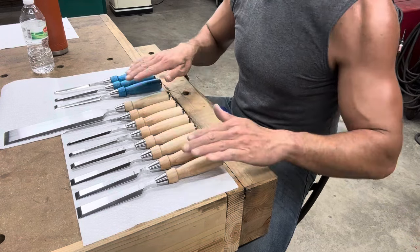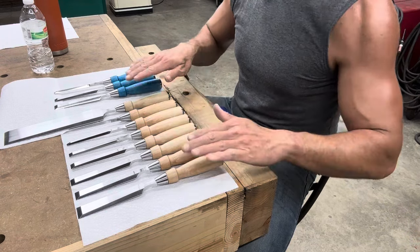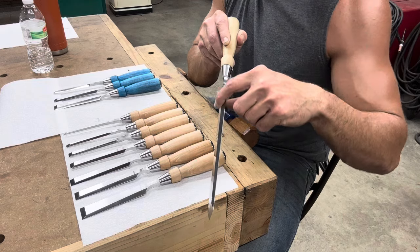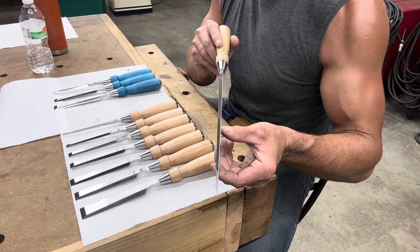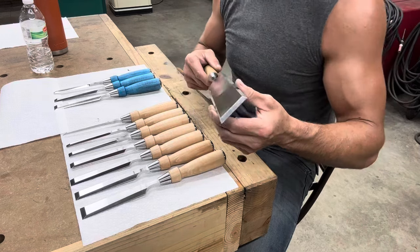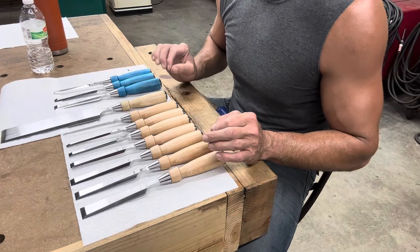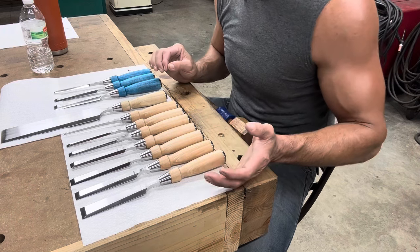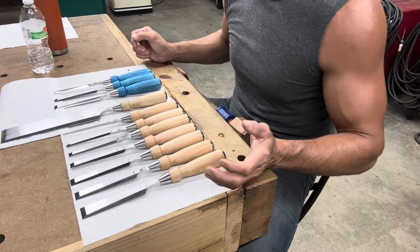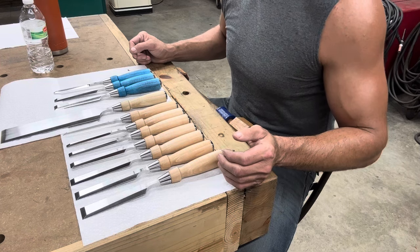It's always a challenge no matter what tool you're making — especially since these are all tapered. They're wider at the back than at the cutting end, ground to a thinner end, and that taper makes them want to bow toward the edge. That's another factor that needs control. There's a lot of little things that go into making a blade that's actually straight and at a Rockwell high enough to be usable. I've had blades at 59–60 Rockwell and running A2 at 59–60 Rockwell is an absolute waste of material.